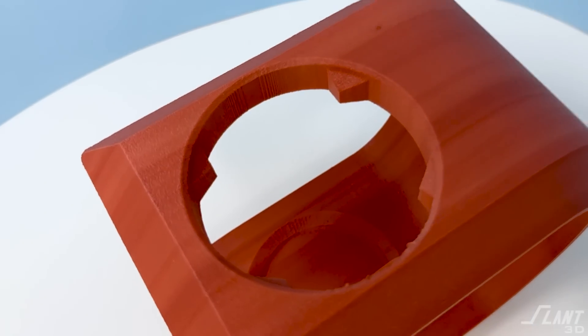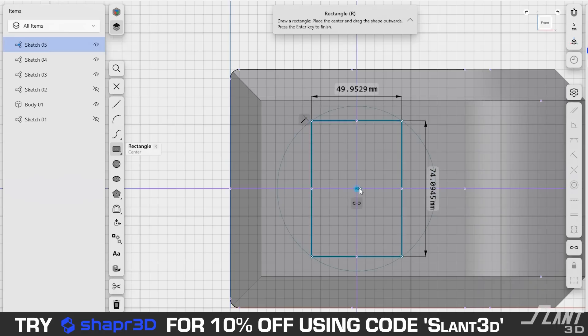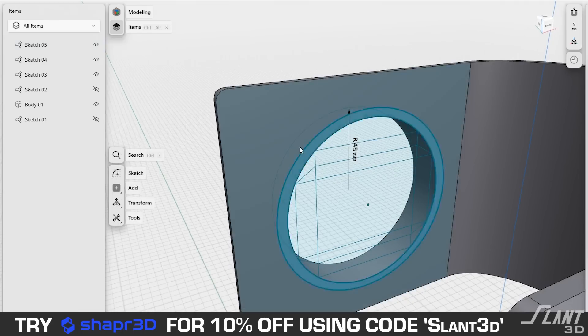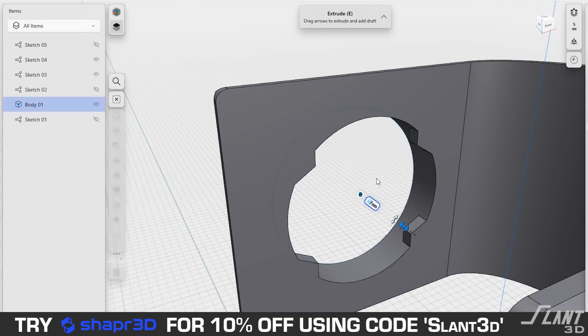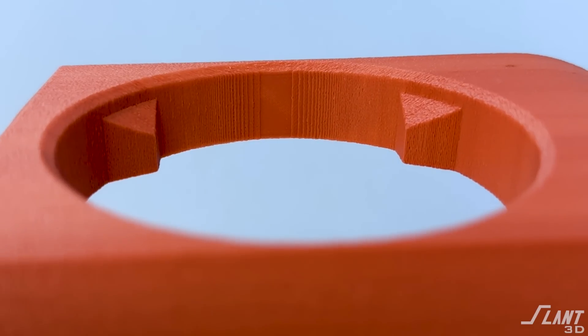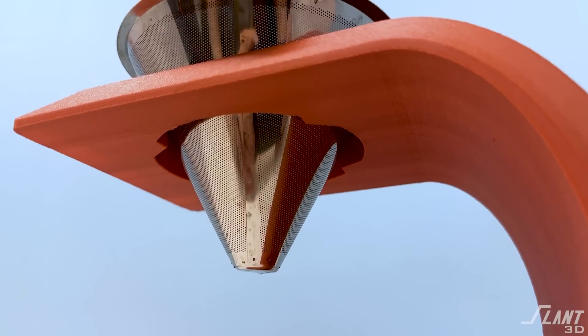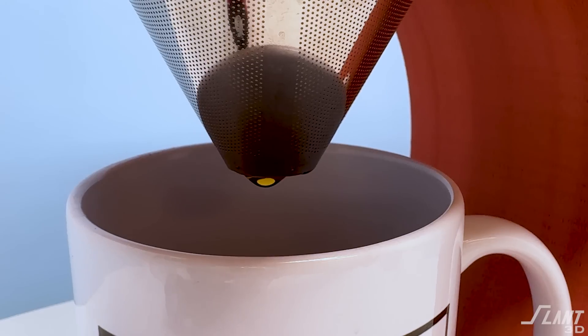Looking at these teeth: these teeth come in from four directions. Normally, something pointing down at an angle like this would need support itself. But what we did was create overhang supports underneath and chamfer them so that they come to a point at a kind of oblong angle, which is then mirrored on the bottom so you can't really tell it was intentional. By creating this symmetrical geometry, you're able to get the points that set the filter off from the printed part. Because when this is plugged into the top, wherever it touches the plastic, water and surface tension is going to pull liquid that direction — which means you could get leaks around the side of the hole rather than the tip of the filter. So having those points guide liquid down ensures all the liquid goes to the point of the filter for a smooth flow that's not really contacting the part.